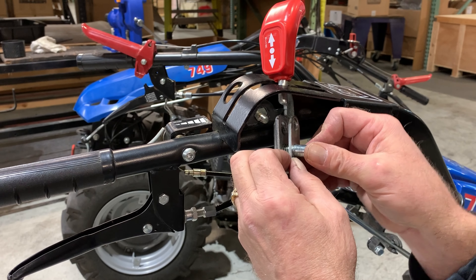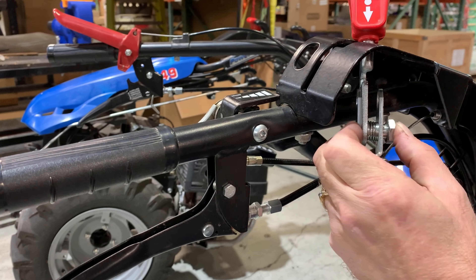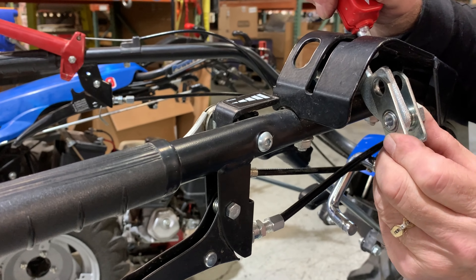Compress the spring with your fingers and slide it into place at the lower end of the fork. From the right, insert the bushing through the lower hole of the fork, the spring, the forward reverse lever, and out the other side of the fork.